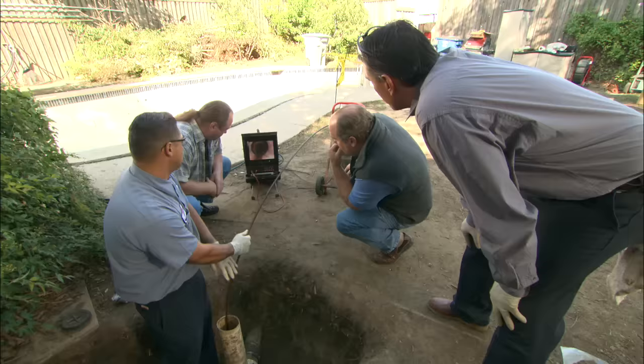There's the PVC pipe going through the foundation — that's the old repair we talked about. There's the cast iron end of the house. So now we're under the slab. There it is — look at that. What we thought: roots coming in at a joint.